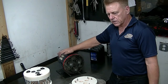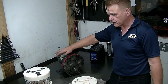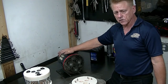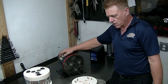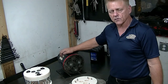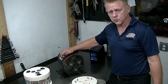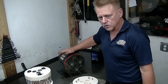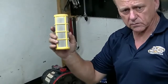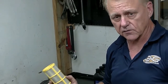We're going to move ahead to the installation of our G&G manifold and valve plates. This is the hydraulic side on a pump that has already been gone through — we know the springs are in good shape. Truthfully, most of the time you'll find that failures on your pumps are due to diaphragm failures as a result of debris getting to the diaphragms through the fluid stream. The cause of that generally is your banjo screen. This filter is your first line of defense against diaphragm punctures.